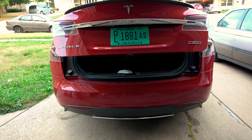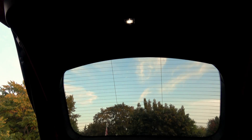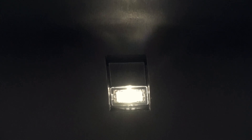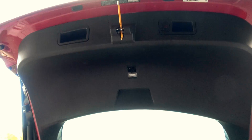Other than that, you're probably wondering, well, what happens if my kid does get their finger stuck in there and we can't get the door closed all the way? Then you will have to use the emergency release, which is up here. This is a mechanical release. This little bugger is Velcroed in here, and you give that a nice swift tug. And that should release what's up there.